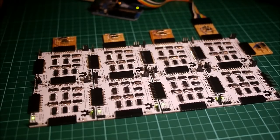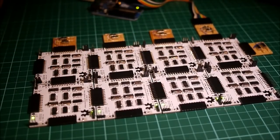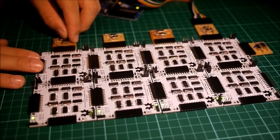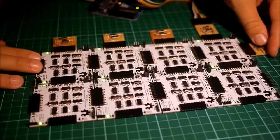In this configuration, these four slices act as registers, storing the data coming in on one of their bus lines when this common bus line is high. We'll set these ones to represent the number 13, and then store the data in the registers.